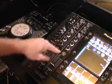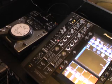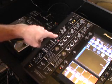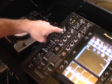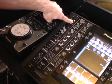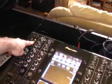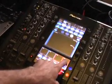Talk over means if you can't be bothered to move the volume controls up and down while you're talking, it'll actually decrease the volume for you while you're talking. Bass, low and high — that's your EQ for your microphone. Microphone level one is your input. Now here, you can actually plug in an external video camera — for example, a standard video camera faced at the crowd — and use that video footage in the mix on channel four.